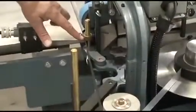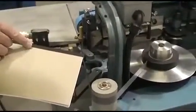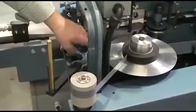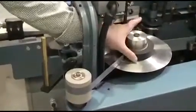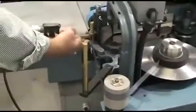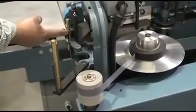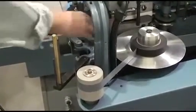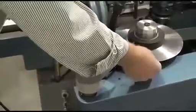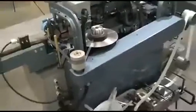You set this guide for the thickness of your tape, adjust it up and down to get your overlap from one side of the book to the other side — whatever you prefer. Then you adjust your tape: it sits on this spool, and the height of the spool needs to be relevant to the height of where you have this set. Adjust that up and down: first set your width of tape, then center your tape over your book for the overlap front and back, then lower the spool to accommodate the height so the tape is running parallel.